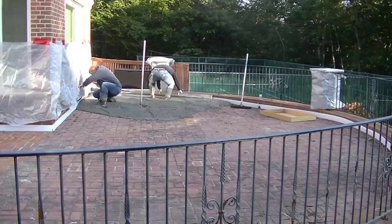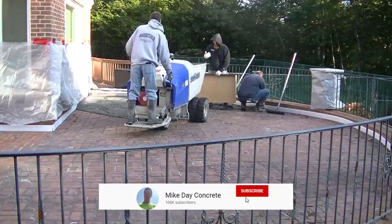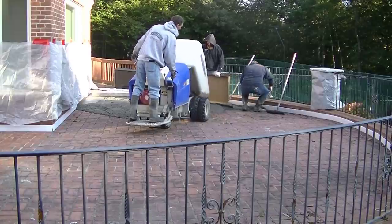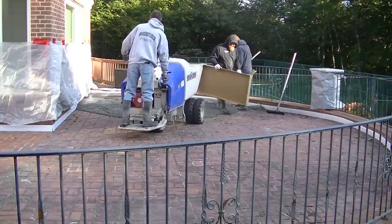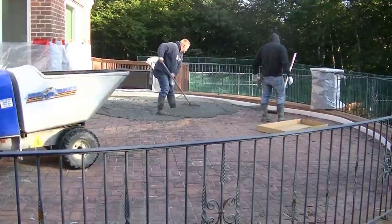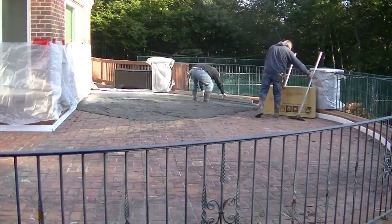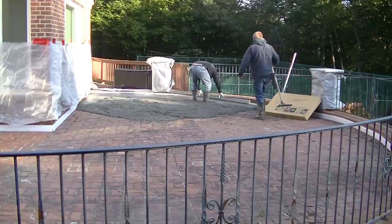We're pouring four inches of concrete, 4,000 psi with fiber mesh, right over this. We decided not to use any wire or rebar because I've got to drive the power buggy over it. The patio here is about 880 square feet, all locked in on all sides, so it's not going to go anywhere, not going to settle or heave. We're going to saw a lot of contraction joints to control the cracks — the fiber mesh is plenty of reinforcement for this.